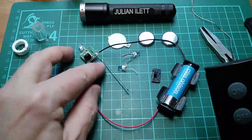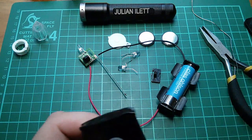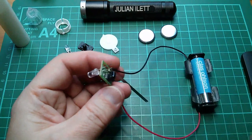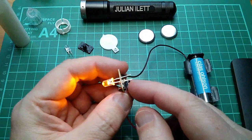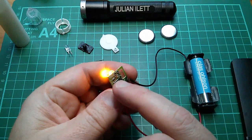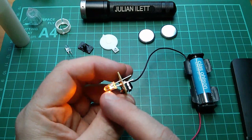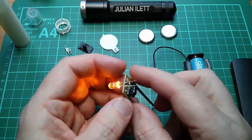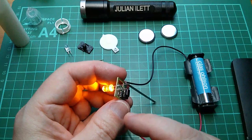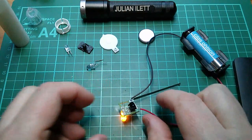Let's check this with the original LED in — so that's the non-flickery one. Yeah, that works: off, on, off. Now I'm going to solder in a flickery LED. Before I solder this, I've just poked the wires through the hole — let's see if that works. On. Oh yeah, that works really nicely — flickery candle LED. It doesn't look like I need to short out that resistor; it's only 33 ohms so it's not doing a lot in terms of limiting current. The LED itself is going to be drawing about the same current as the original LED — it's just that there's a chip in between. A chip should really have a constant voltage within its VDD upper and lower range, but the numbers are all roughly the same so it just works.